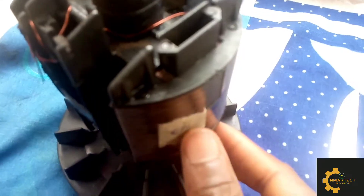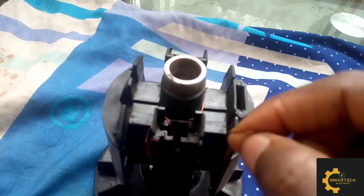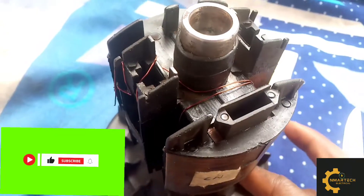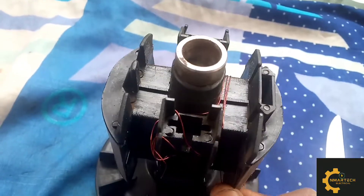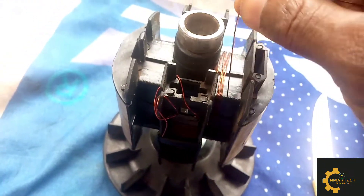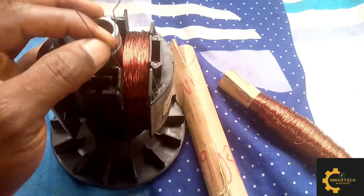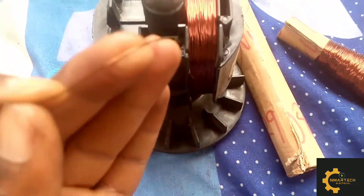This is what I mean by clockwise — winding in the forward clockwise direction. For this work I made use of one pound weight of number 24 SWG copper wire, divided by two: half on one pole and half on the other pole. At the end of the clockwise pole we have two cables — the start wire and the end wire. Please take note of this. The innermost wire is our start and then we have the end.